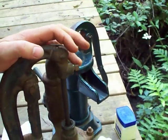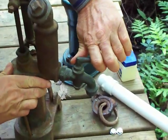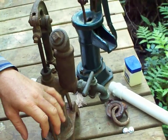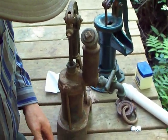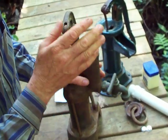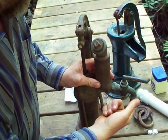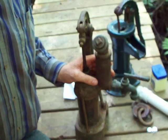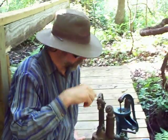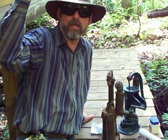The reason for that packing nut is this is a pressurized pump. This one has got an actual spigot that you can open and close — it's got a petcock spigot, which I really like, because you never see that anymore. This pump is over 100 years old, by the way. This one just has an open trough that the water comes out of. Because this is all pressurized, you close that spigot, you can come back in a month and you still won't have to prime that pump. Not only that, but when you open this and start pumping, it's actually under pressure. You can hook a hose to this, take it upstairs in your house. If you've got a water tank in your attic, you can pump this thing here, fill your water tank in the attic, and then you have gravity feed the rest of the day. If you want to take a shower or get a glass of water, the attic tank will feed that. Every day when you get up, the first thing you have to do with your chores is pump that tank up.